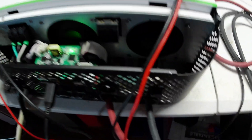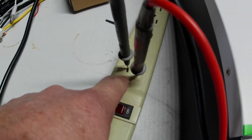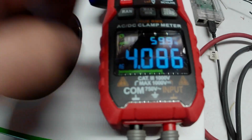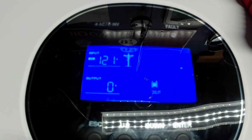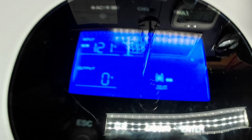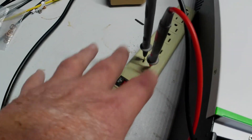Right now the unit is powered off - it's red and blinking. I've got my probes set to the power strip and it's hardly even registering any voltage at all. What I'm getting on the display: 121 volts coming in, zero volts going out. My little indicator is flashing about the solar cells not being connected. What it would not do is when I flip this switch, there would still be no power coming out.